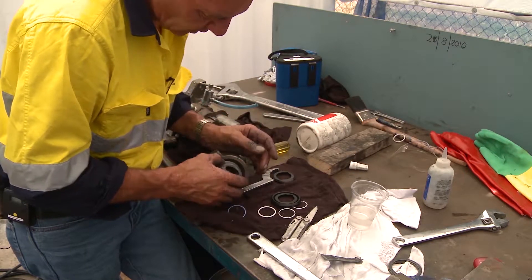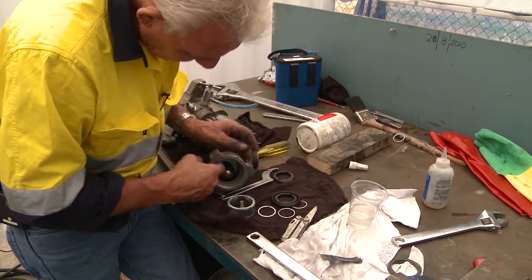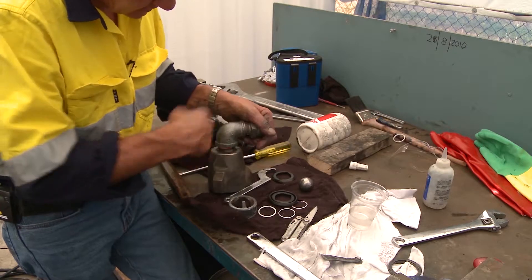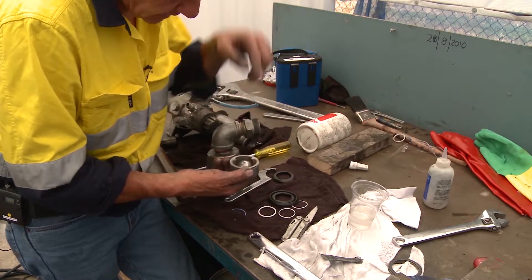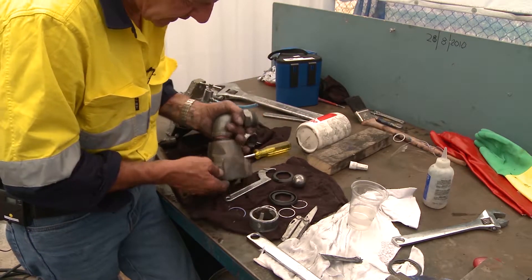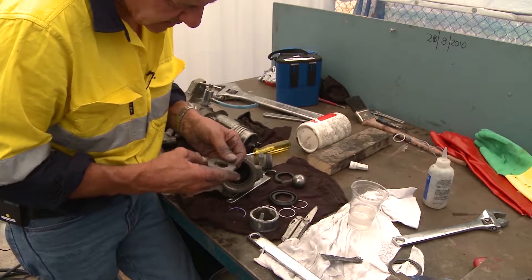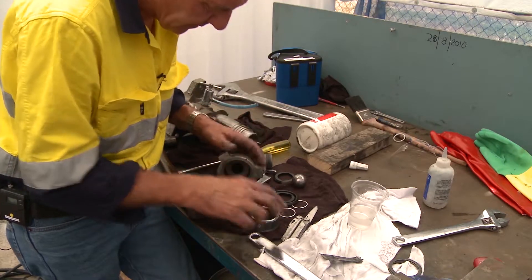If there's a massive paint build-up around the top, you may have to put this in a vise, take the elbow off, and use a drift — hitting the ball only, not the seat — to drift it out from the top. You'll mainly find that if the machine hasn't been cleaned appropriately over its life or during packer replacement. Remember the seat is double-sided — pick the side that was in there before and slide it back in.